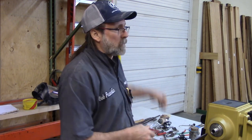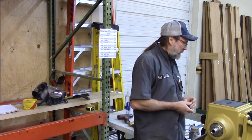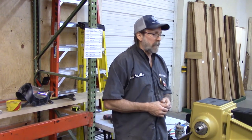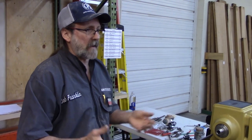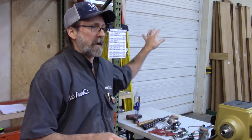There's a difference between plastics and acrylics too. The blanks you get here at Woodcraft and Rockler are an acrylic blank. Think of plexiglass. It's a type of plexiglass. It's a true acrylic. The blanks that anybody else makes and you buy online from different people on different pages are going to be a plastic of some sort. They're going to be made with either epoxy, polyester resin, or a urethane resin, which is what we use. So they're less brittle than the blanks you get here.